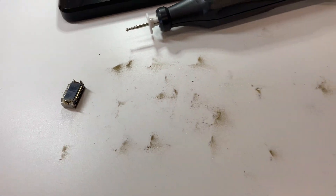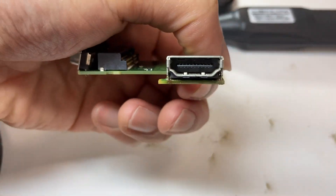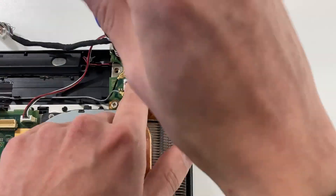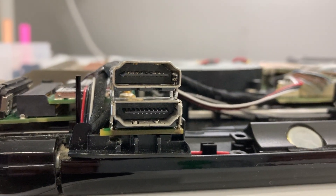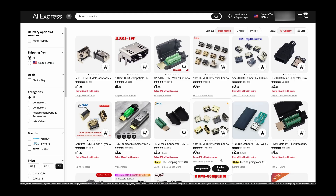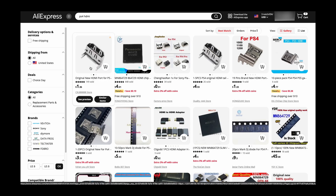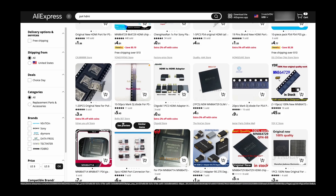What a mess we have made. This is the new one and this is the old one — it's time to plug it back and resolder it. Everything looks good so far, until I try to close the laptop case. We have a problem: I just can't seem to close the laptop case. The replacement has the wrong orientation. I'm too exhausted after all the grinding and thinking — let's continue tomorrow. I can't find any HDMI port with the same orientation and anchor point spacing as the original. The only replacement with the same orientation is the one for PS4, but the anchor point spacing is different.